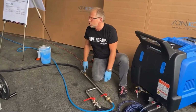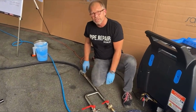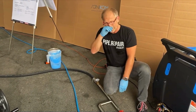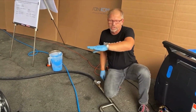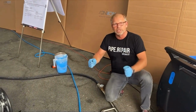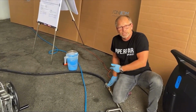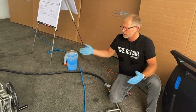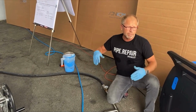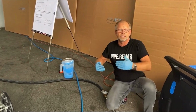For a beginning, I always recommend to have here around about 80 degrees, then you will have on the pipe around about 60 degrees. And when you can measure this temperature also on the end of the pipe, then there is a good balance in it, and then you can increase the temperature up to whatever, 90 degrees for example, then you will have around about 80 degrees on the pipe, 70 to 80 degrees. It always depends also on the surrounding ambient temperature. When it is very high, it is easier to come to higher temperatures.